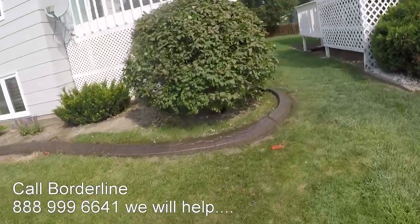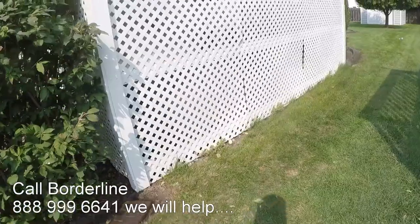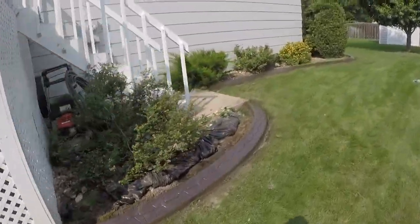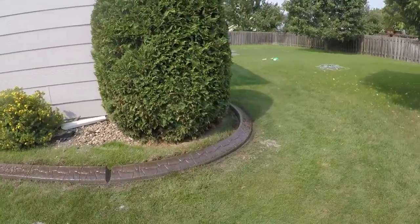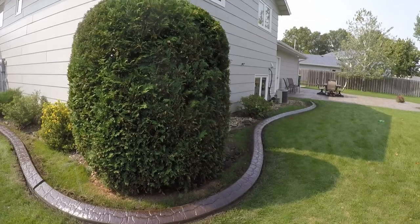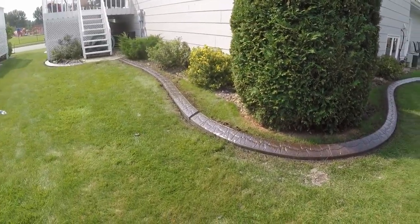Alright, we're all done here. I just got to run a shovel and do some cleaning. Those are sealed with three thin coats. We have probably 165–170 feet here, and doing three coats of sealer I probably used about two gallons of seal.